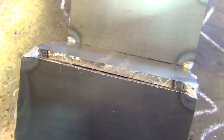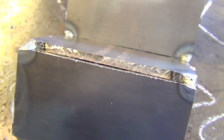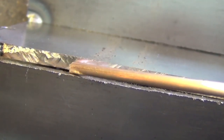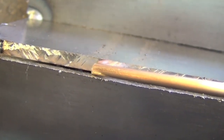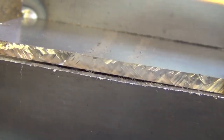I've chosen the outside corner for the first type of joint we're going to be welding because, in my opinion, it's probably one of the easiest types of joints to weld. Pretty much all we have to do is make our way down the joint and apply filler metal as needed — the sides are already clearly drawn out and that'll help us keep things under control.